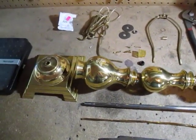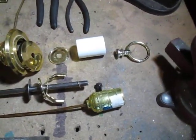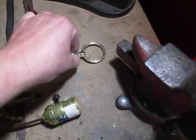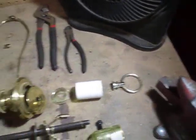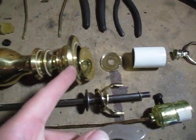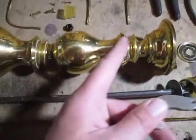In the other video you saw what this looked like when it was put together. I did take it apart and tried to put the pieces out kind of how I took them apart. At the very top of the lamp there was this piece here — I scratched it with a file, and that'll also tell you that it's brass, or you can use a magnet. This next piece sticks to my magnet, so it's magnetic. The next little piece is also magnetic. Then we start getting into the brass — all of this is nice, solid, heavy-duty brass all the way down to the base. This piece here is steel; it's the piece that ran right up the center and held all of those pieces together.